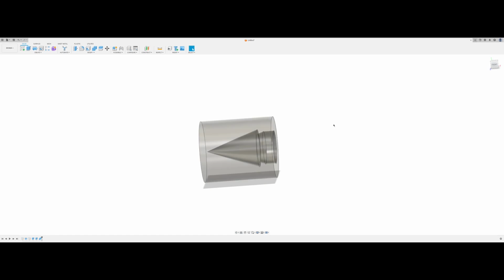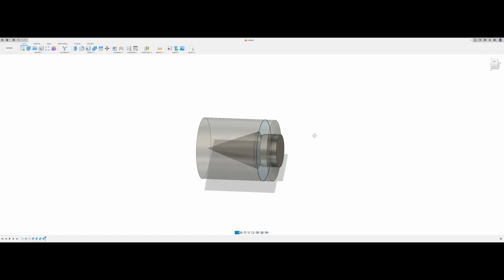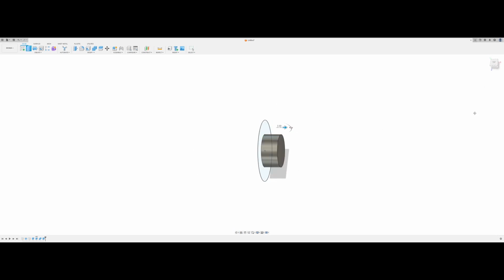One important feature you will need, regardless of mold style, is a straight or nearly straight section where the two pieces of the mold can be compressed together. This will allow the chopped carbon tow to fully consolidate inside the mold, as well as force out any excess epoxy that you may have needed.